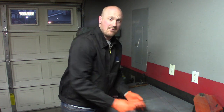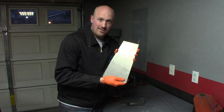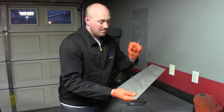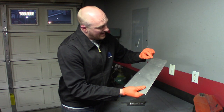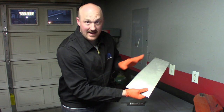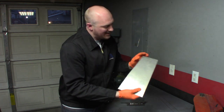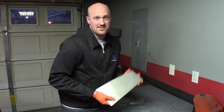That's especially true if you're working with something like 16 gauge sheet metal — which is actually really thick for sheet metal — because even so, if you just run a bead all the way down, it's going to look like a pretzel when you're done. Especially when you're dealing with sheet metal down to 20 gauge, really just tack, maybe run a short bead, gap by quite a bit, tack, short bead, tack, short bead. After it's cooled through that initial pass, go back and weld a little bit more. Patience is your friend.